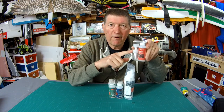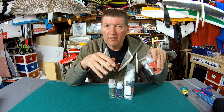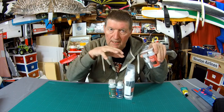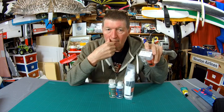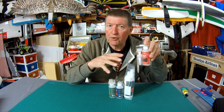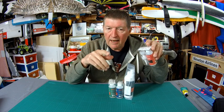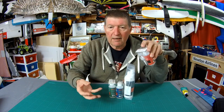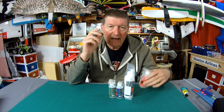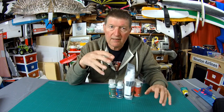It's generally a fast-acting and strong glue. You can get it in a variety of different thicknesses for different applications. The classic one is the thin CA glue that wicks into tiny little spaces. On the Star Bond website — a fantastic website by the way, with tutorials — you can see they have everything from the thin stuff right through to thick and flexible, and even colored CA glue: black, white, brown, and pink. The black stuff can fill knots and cracks in woodwork.